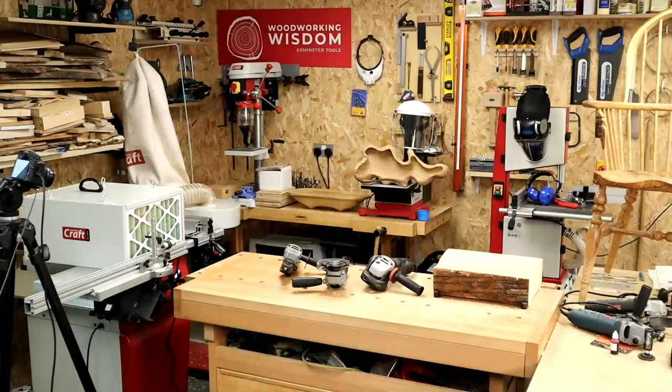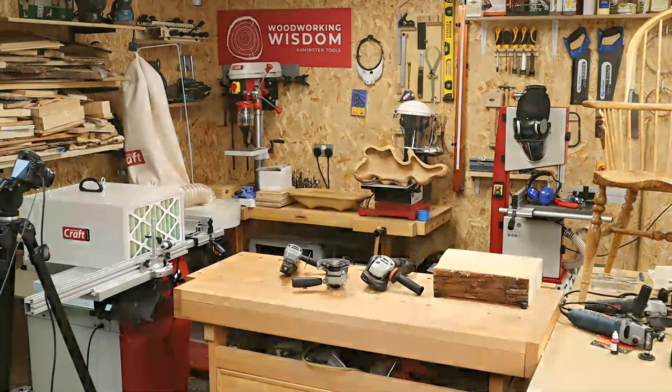Okay. So if we pop back onto that camera three there, hopefully you can see where this has been rough sawn here. We've got the bandsaw marks coming down here, and we've got this area here which we've just skimmed. And actually really clean, not too much torn grain. We've got a little knot down here where it's just picked up on the end grain coming up. But otherwise, a really nice clean cut. Okay, a little bit of sanding, and that would really bring that home.